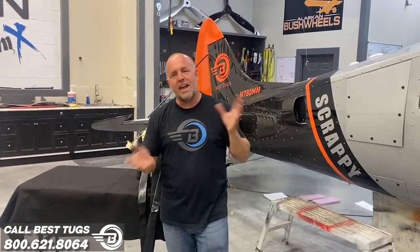Here's what's cool. A typical aircraft, you want to keep it in the 28, 32, 34, 35 feet per second range, somewhere in there, depending on the aircraft. More travel can handle higher sink rates on the suspension, and obviously less travel suspension has to have a lower sink rate.